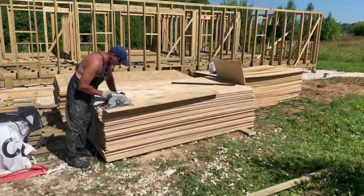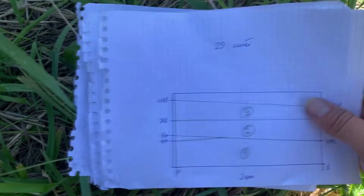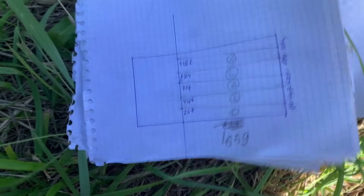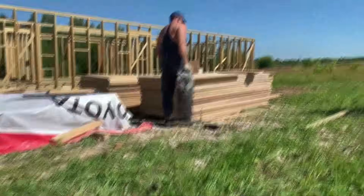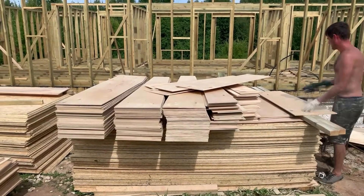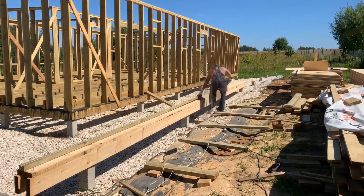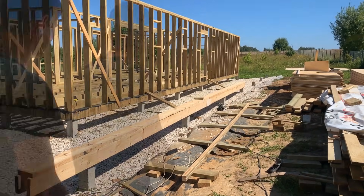We made a jig on the piles of the future terrace on which we assembled the beams. Next, we started cutting plywood into elements. Here's what my sketches look like, where I drew and listed all sizes and how to arrange elements so that there would be as little waste as possible. One person lays out the plywood, another cuts it with a circular saw, and a third moves everything at the right time. It's only long and monotonous. Then the most interesting thing started — assembling all of this into one piece.